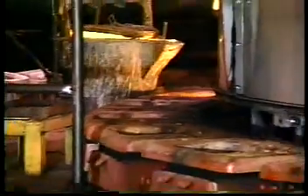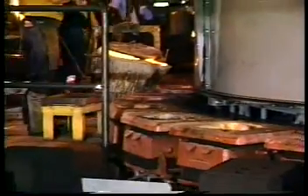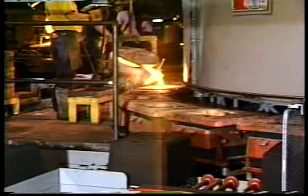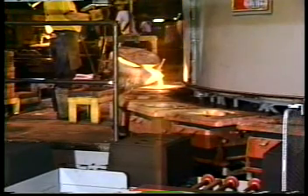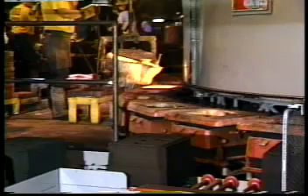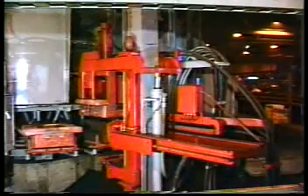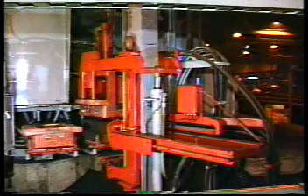Batch mold pouring: the table is preloaded with un-poured molds with weights and jackets in place. The turntable is then rapidly indexed on command or by an adjustable pouring timer. This method provides single station pouring at unrestricted speeds.